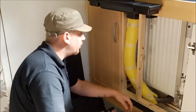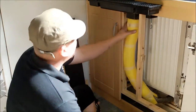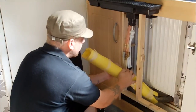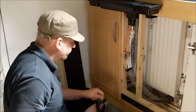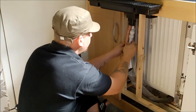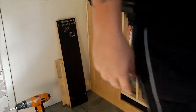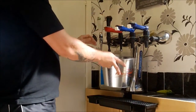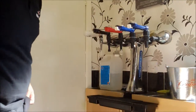That's the front fascia board off the middle of the bar cupboard, and behind it you can see the pipes we want to get to and detach — you can see the connections holding them together. So I'll have to get this insulation off. What we have here are the two coolant pipes which are still actually flowing, so I'll have to go and turn them off. What we've done is turn the pipes off and run air through them. As you can see, we can open all five taps and there's no pressure in there now, so they can just be left open while we concentrate on this down here.